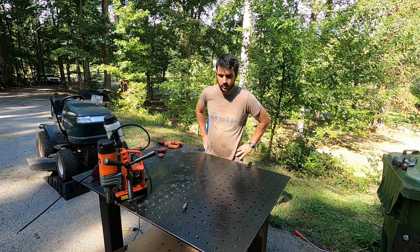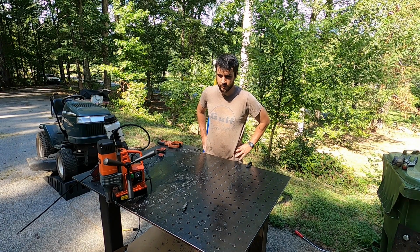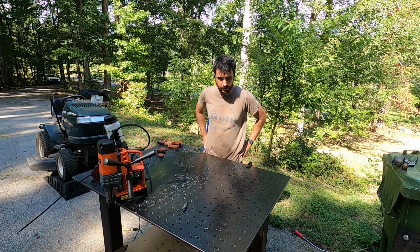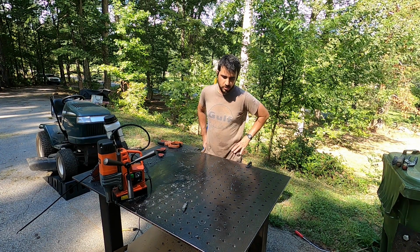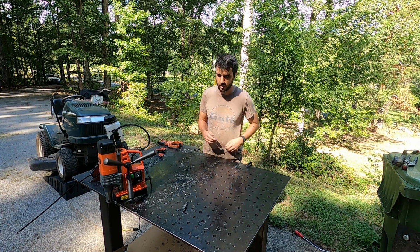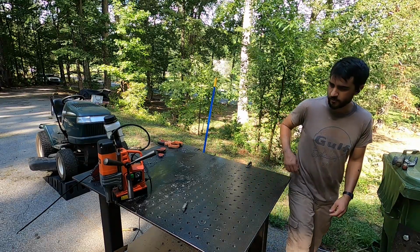Weaver mag drill is starting to wear a little, and my eBay China special 5/8 annular cutter failed on the 185th hole. So I was wondering how far I'd get. The answer is 184 holes. This is 1/2 inch steel plate, and I was putting holes where the tabletop was welded to the legs and some of the cross bracing. So it was doing some interrupted cutting. Might have lasted longer had it not been doing that.